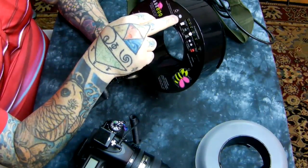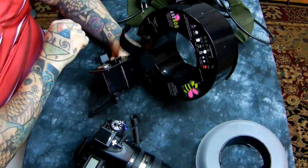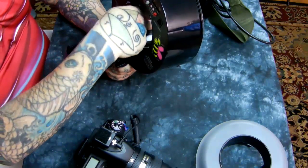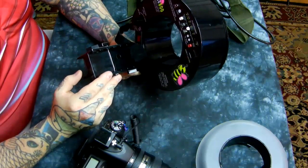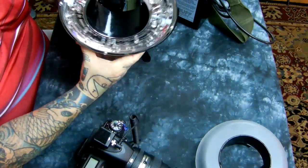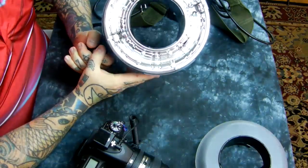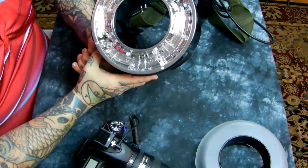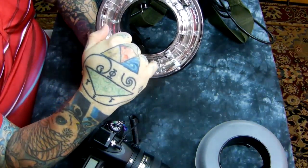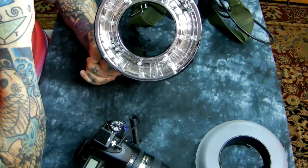It's a 1⅛ inch slave. This is the locking knob for the diffuser and the reflector — it activates two switches on the outside ring and the inside for locking in the diffuser and reflector. It is fan cooled, very lightweight, and very simple. The next ring light above this is rather expensive. It does come with three additional modeling lights, not additional xenon tubes.